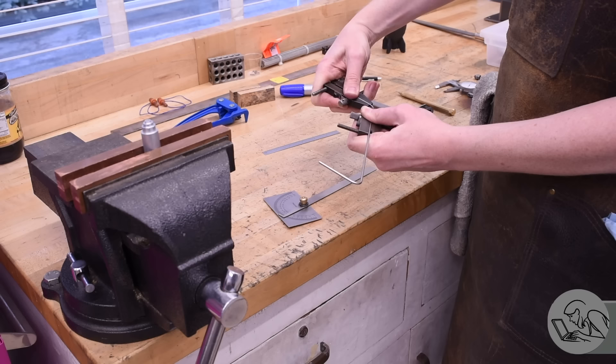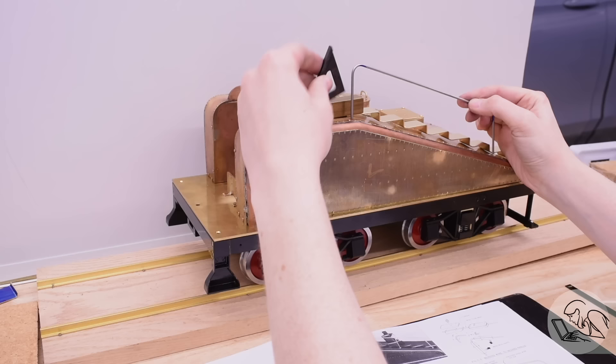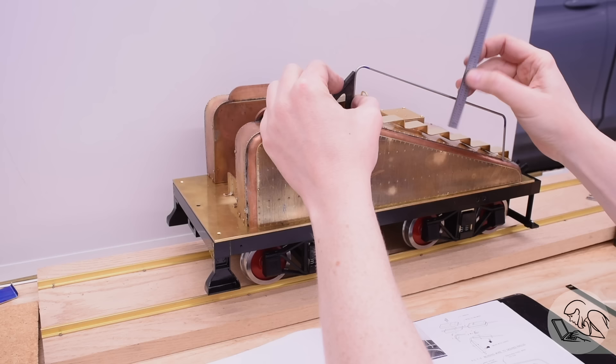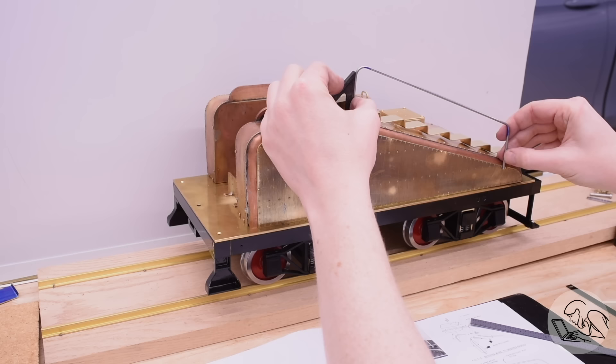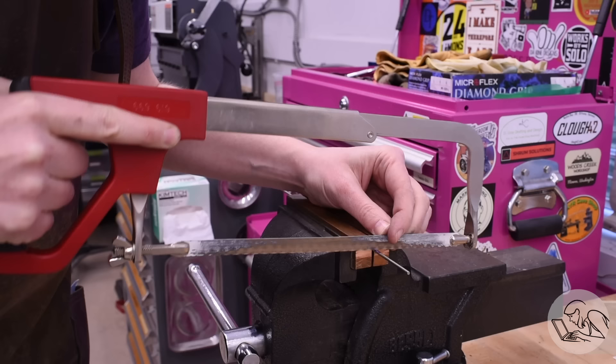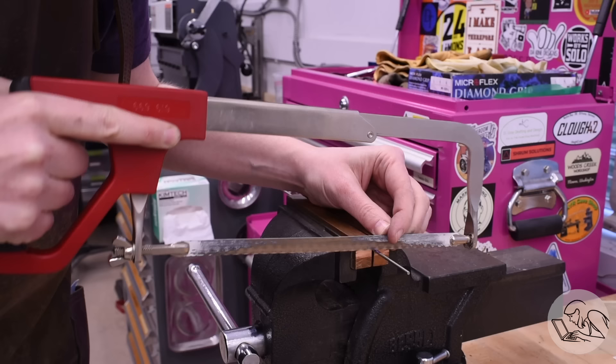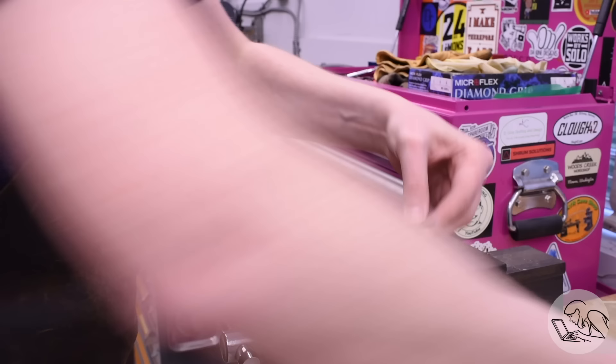I've got some tricky angles to hit so I've got my protractor out. It looks like I'm in the ballpark on that first bend. These first two bends are really critical because they set the overall length of the railing, and I've got to get the angles just right to match the tender. With the upper stanchion vertical, the lower stanchion should end up in the right place and the space between the tender surface and the rail should be the length of the vertical stanchions. I just barely got away with that in the 12-inch length, so I'll rough cut the two center stanchions from another piece of this wire — a regular hacksaw cuts it just fine.